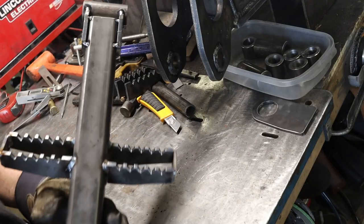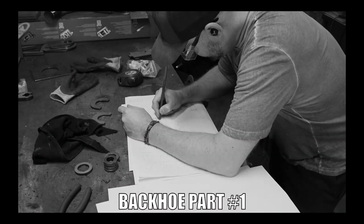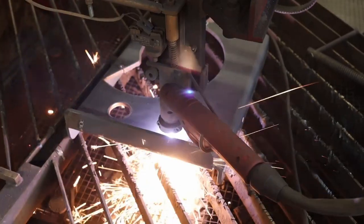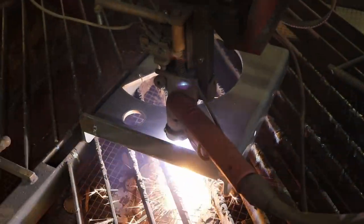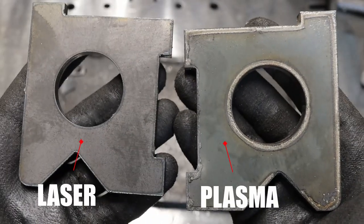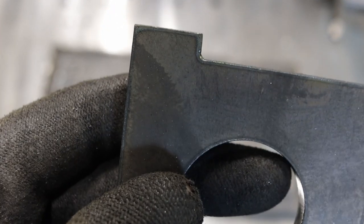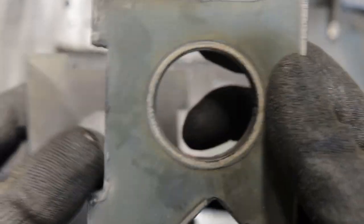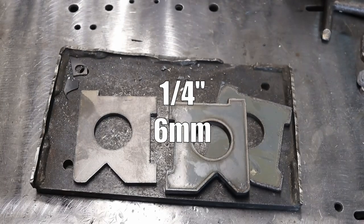Here's a step on both sides. You might recall that in the last episode, during the design phase, I kind of forgot to send some parts to be laser cut. Well, today it's still the case — I'm still missing parts from that initial mistake. But on the plus side, that gave me a chance to compare the cut quality from a proper laser cutting machine to my DIY, kind of cheap, CNC plasma table. It's obvious that the laser cut part has sharper corners than the one from the plasma, but overall for that kind of thickness, I'm pleasantly surprised.